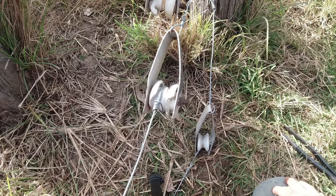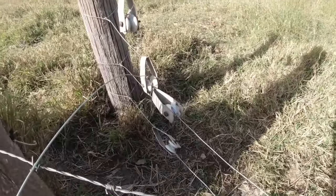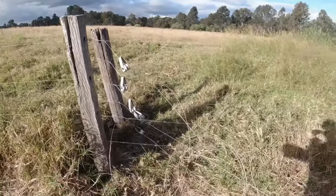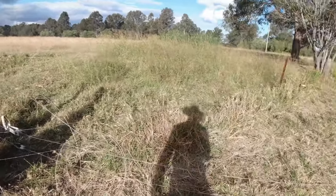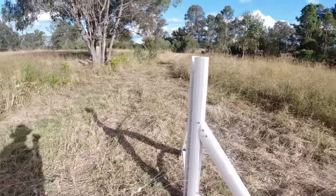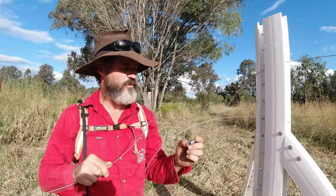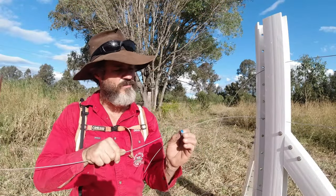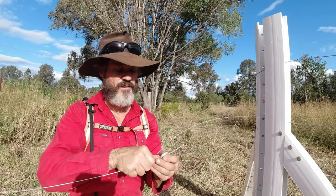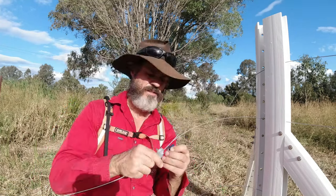I'm going to tie the rest of these five off now and we'll get on with it. So I've tied off all those porcelain insulators — all five of them — tied up there with the five wires hanging off the end. I don't generally like to let high tensile wire spool like that, but I wanted to show you how these gripples work. I'll bring you down and hook up those last three. As you can see, I've already got two joined in there. These are a medium sized gripple — it's got the name gripple on it. You'll find there's two holes at each end.